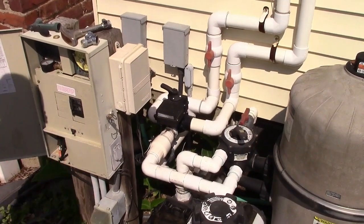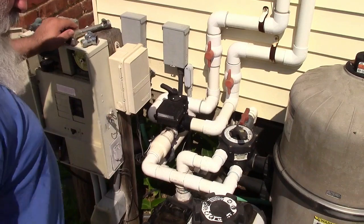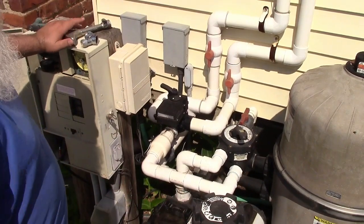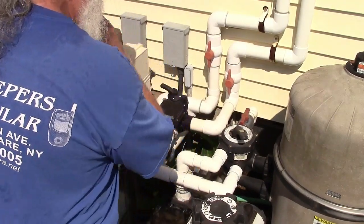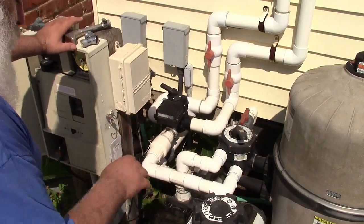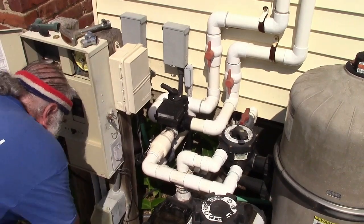Now there's still some leaves and other stuff that's going to either be in the second vacuuming or when Robot goes in. But we need to reconfigure the pool equipment to go back to normal operations. So let's do that. What you're going to want to do at this point is disconnect, take your vacuum out of the pool. You should have done that if you're done vacuuming. I mean, it only makes sense, but you got to tell people this. And what we're going to do now is leave it on waste for just another moment. I'm going to open up the other skimmer and the main drain and let all of that in.